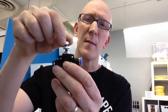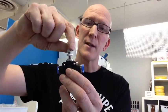There's this other little dial underneath here, and I'll show you what that is in a minute. But what happens is you turn this all the way up, start running your water through, and see what the flow is like coming out of your water-fed brush. If it's too high, you can simply turn in a clockwise position from the top dial here, and as you go down and down and down, the flow of the water will be decreased. So instead of shooting out of the brush 4 or 5 feet, it might just be a foot, foot and a half, whatever your desire is.